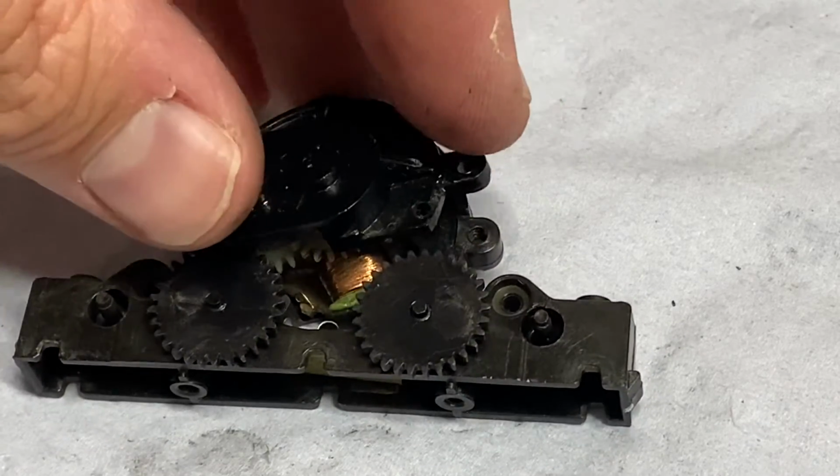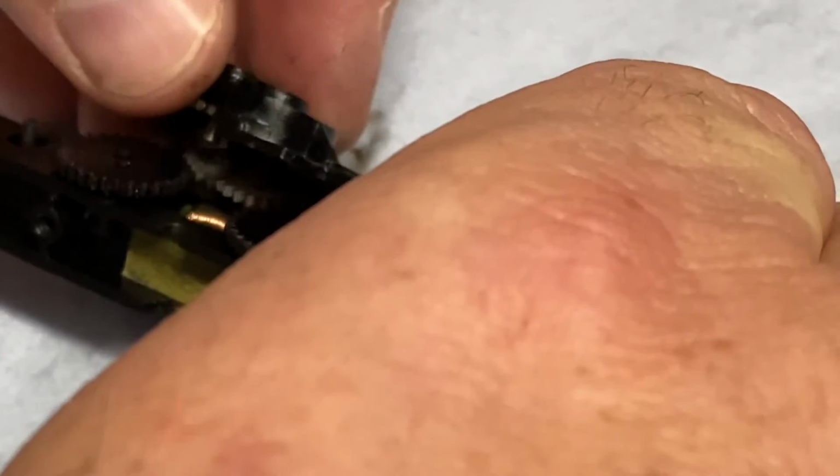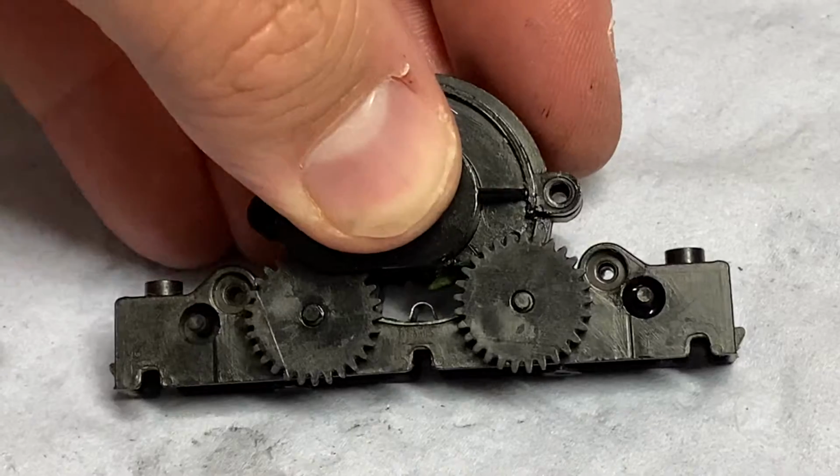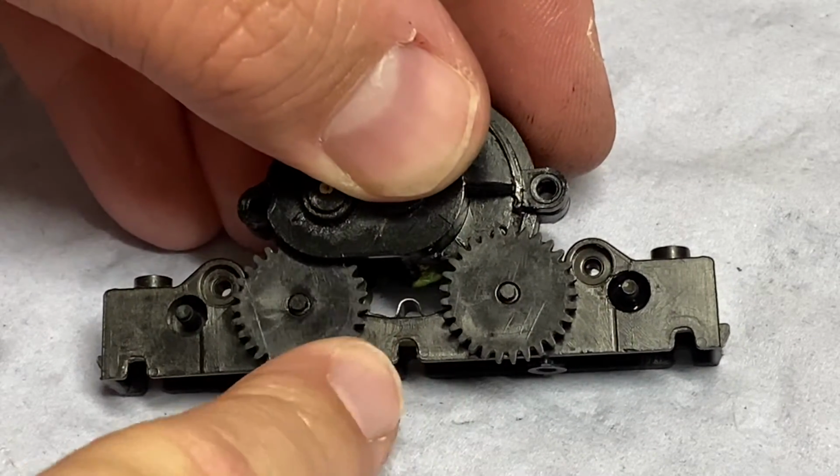As you can see in this clip, I've put on the right hand large gear on the tender frame and I'm struggling to get the keeper plate on. That right hand gear doesn't go on until the keeper plate is on. That goes on second. That was an error I made, but every day is a school day, as they say.